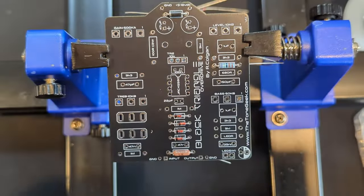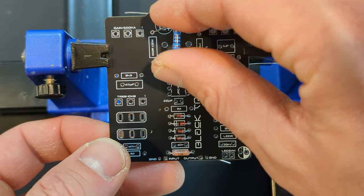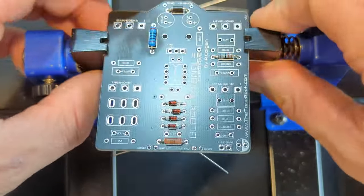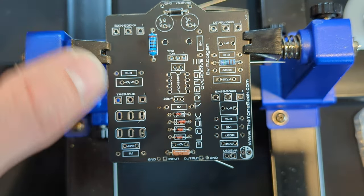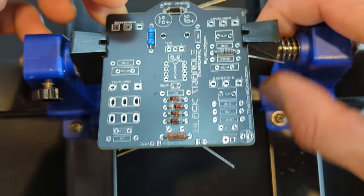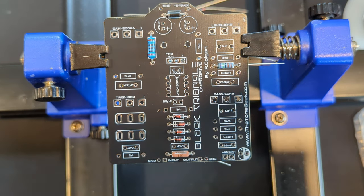Next up is a 100 ohm half-watt resistor in the power supply section. Basically it smooths out ripples and prevents low-frequency noise in the power supply from entering the circuit and creating noise. This 100 ohm does have voltage dropping through it. It doesn't strictly need to be half-watt — I think that's just an over-engineering thing from the original Vemuram circuit, so I stayed true to that. I think people appreciate that these circuit boards remain true to the original design and intentions.